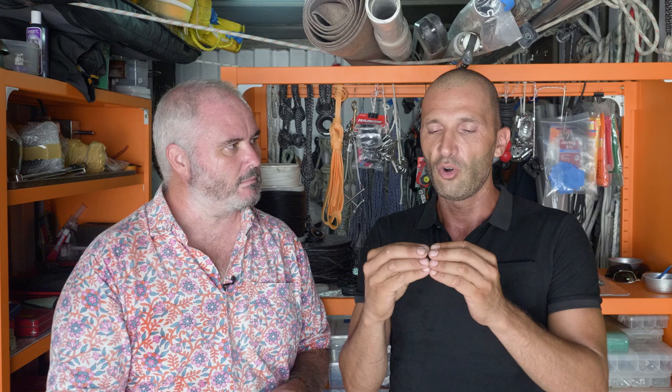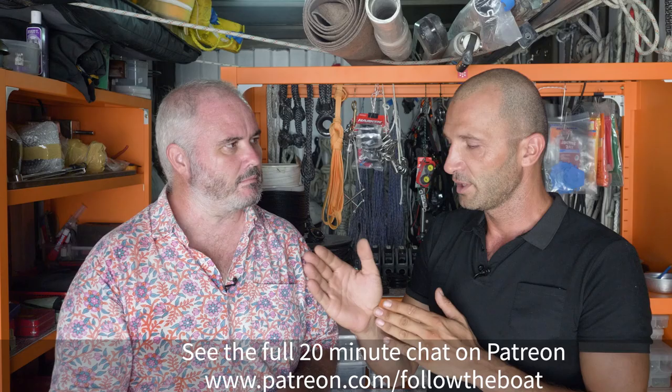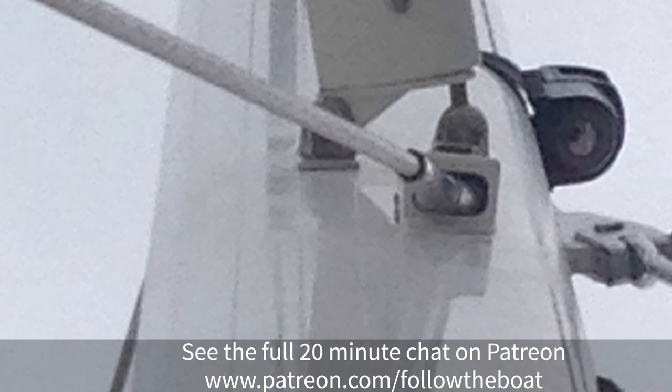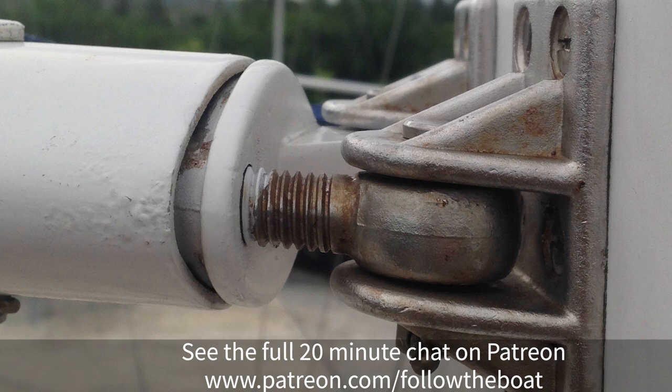When you pull the clevis pins out you see corrosion on them. If it's an old clevis pin, ideally you replace them — you don't keep them rusty and old with cracks. I have many samples here, you can see big cracks on some of them. I also looked for misaligned wires — if they were pulling at wrong angles where the terminals meet the wire. You had one of those, on the starboard side, and that was from wrong tuning of the rig. Your rig was out of alignment and one of the spreaders was pulling slightly aft — you could see the gaps where the spreaders are sitting on the bases.